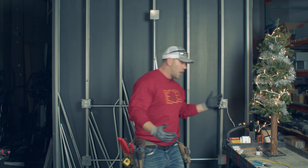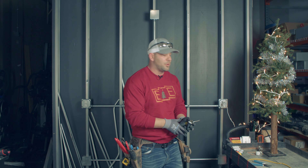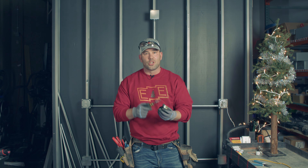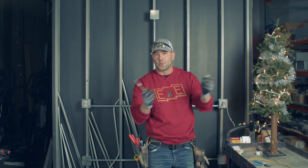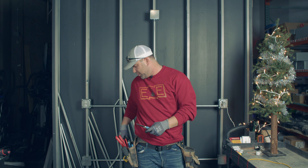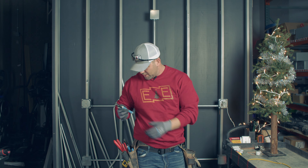Anyway, we were talking about cord plugs. You want to use three-wire with three-wire, and two-wire with two-wire. You just take them apart, land the hot to the gold, the neutral to the silver, and the ground goes to the third prong — whichever screw that is. It's pretty easy, honestly. I didn't even need to make a video about it.